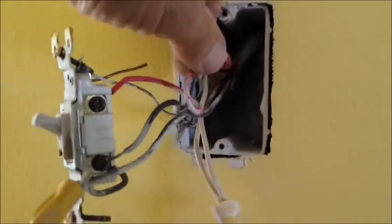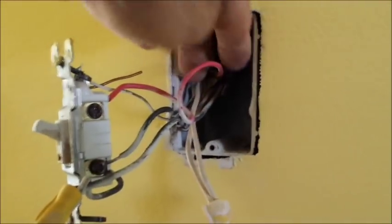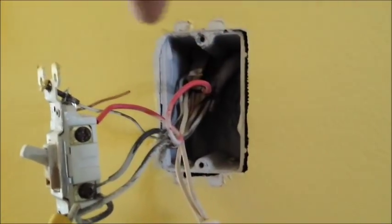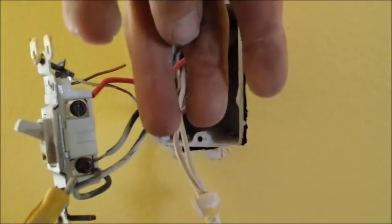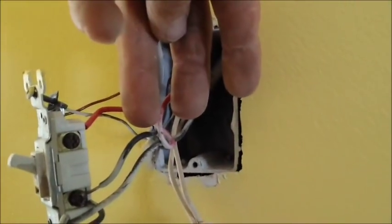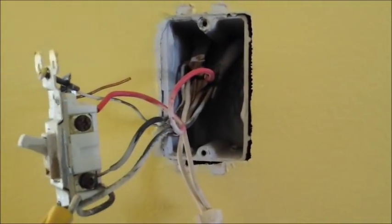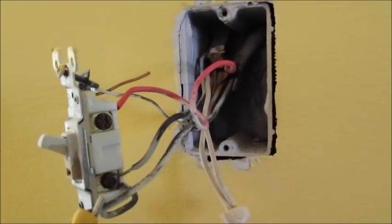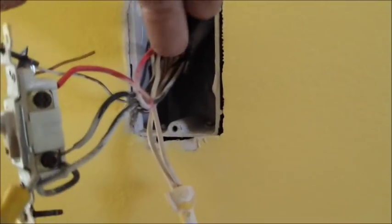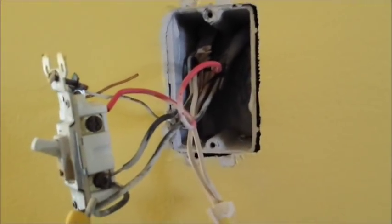So what that tells us is that we need to abandon this red conductor, just cut it off and take it out of the switch. We need to feed a new wire into this box from the attic that will control the fan and the light. We're going to use a three-wire when we feed it into our box because we want both up by our ceiling fan — a continuous hot wire to control the ceiling fan on a pull chain, and a red wire on the switch to control the light. That way, whether the switch for the light is on or off, the ceiling fan pull chain will work just fine.